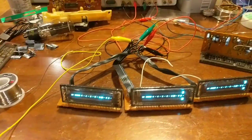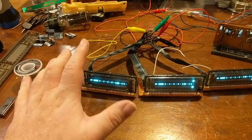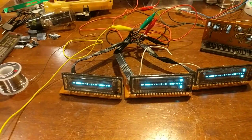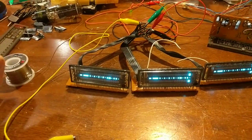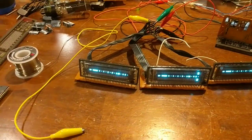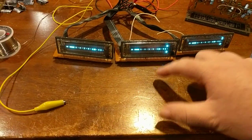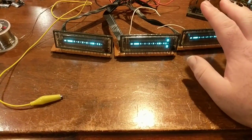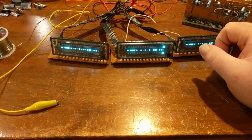At the same time, I have to have a secondary configuration page because the heart of this thing is going to be a dual 20 watt Class D power amplifier circuit, which I'll show you in a second. That Class D power amplifier has a built-in parametric EQ, which is set up using biquads because it's a DSP. So I think what I want to do is go from the Raspberry Pi to a line level DAC, and that line level DAC is going to be a fixed output that'll be tuned to the VU meter to keep things accurate as best as I can, although accuracy is not really much of a concern here. It's more for show than anything.